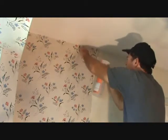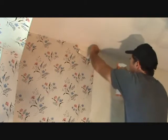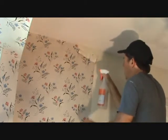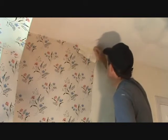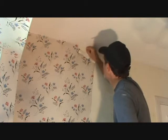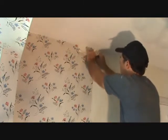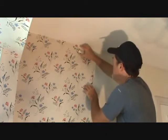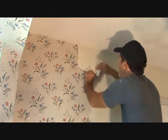I'll get that a little bit wet up there. I forgot to do that when I sprayed this, because I want to peel that down after it's wet — it won't take that long once that's wet because that's the back side of this paper. Now that I've got it saturated up here, it's a lot easier. Now I can kind of gently pull that back down to the rest of the paper, or I can just start back down and rip it off, then take a piece and rip it up forward and get it. But once it gets wet, it's surprising how easy it is.